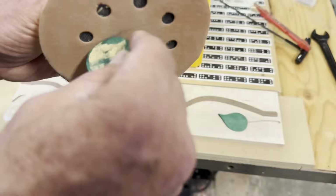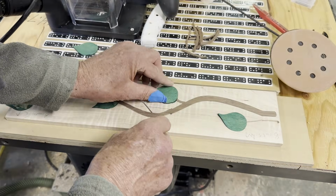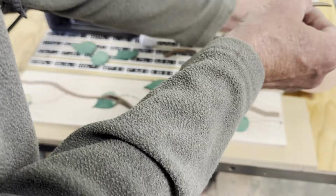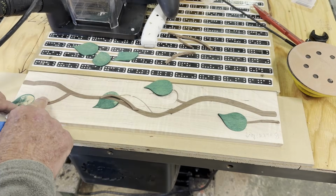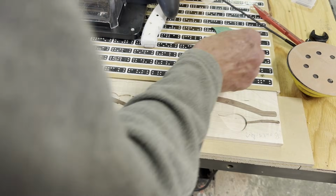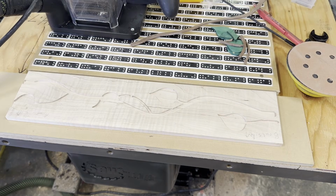This shows one of my little mistakes. I had hoped to make the leaves green on this project. That ended up not working because the green stain I put on wood that's otherwise yellow just sanded off when I went to smooth out the box after putting in the inlay parts. So I ended up with kind of yellow leaves with a little bit of green staining around the edges. They don't look bad. It's not what I intended though.